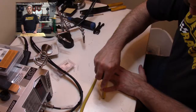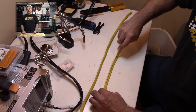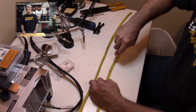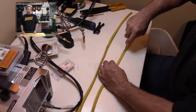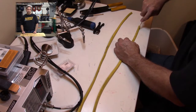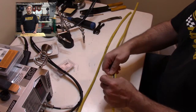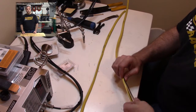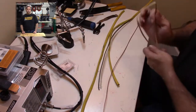There are two segments. The first thing I did was cut some of that Romex cable about 3 feet — you want to make it a little bit longer than your antenna length — and strip out the metal conductor, the ground conductor, out of that, because that's the only one you're going to use. You probably could use either the white or the black conductors as well; I don't think it really matters if your antenna component has insulation on it or not, but why bother having that when we're not going to use it.